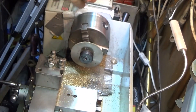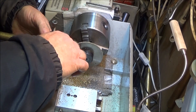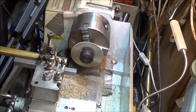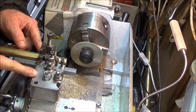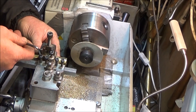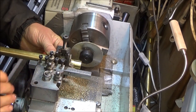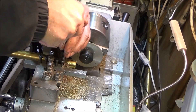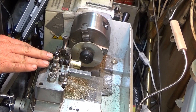If it's not deep enough you can just put the holder back in and machine a bit more. The beauty of this setup is that you can take it out as many times as you want to measure up without disturbing the position of the bar. If you make one up you'll be very pleased with it because it gives you the opportunity of machining many different items. I use it for all quick milling jobs and small jobs. You can just loosen off the bolts on the top of the holder and slide it to whatever position you want, giving great versatility for travel on the cross slide.